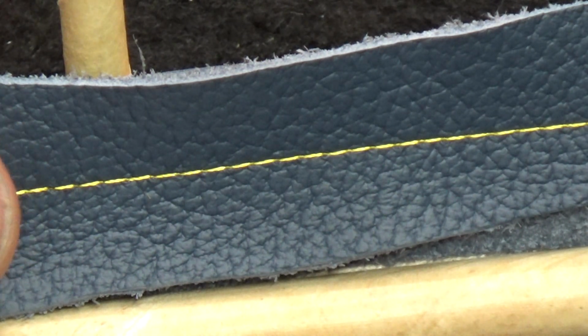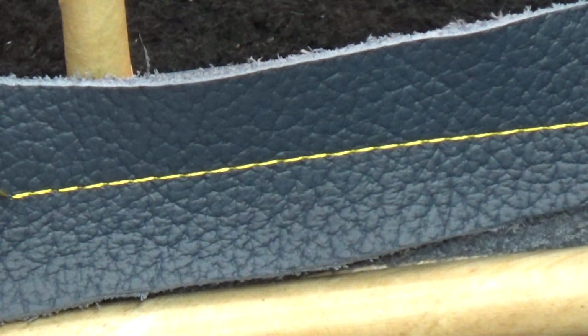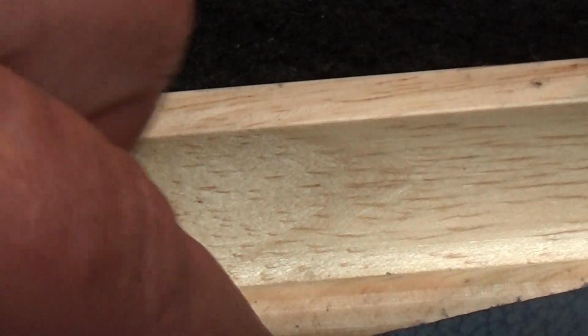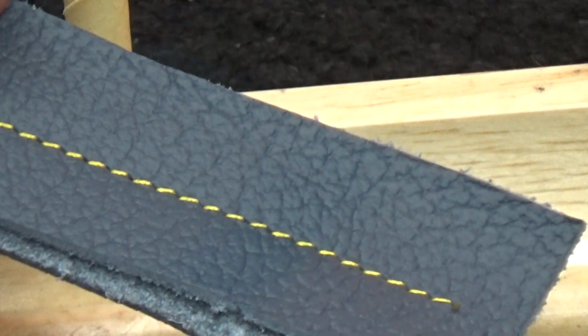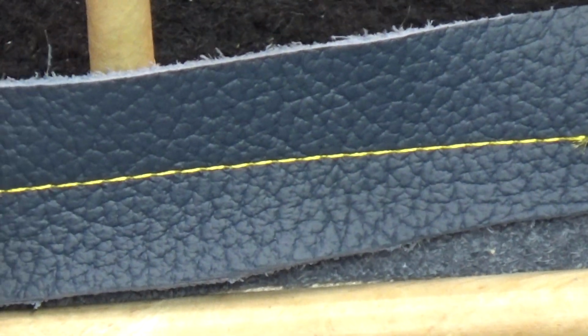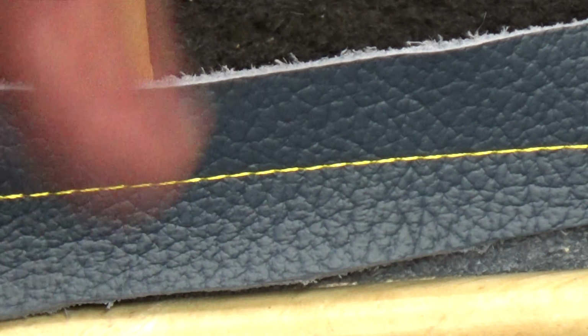So a definite pass, 2 layers of protected full grain leather, about 8 ounces of leather cranked off by me. We got a spot on top stitch, a page 34 top stitch without a doubt, a page 34 provisional lock stitch, understanding that if we want to make it absolutely rock solid, no wavering, page 34, that we would bump up that upper tension just slightly to make this more poppy.